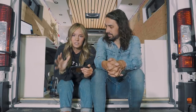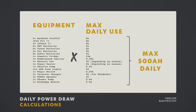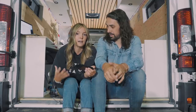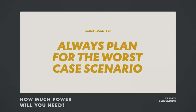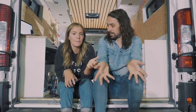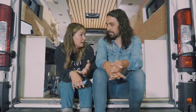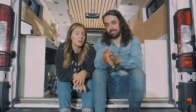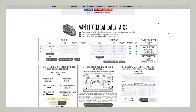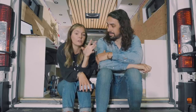Our total, when we use all of this together — and that's obviously the maximum — is around 500 amp-hours daily. So we know our setup needs to power 500 amp-hours on a daily basis in the worst case scenario. You always want to calculate your worst case scenario. It's rarely going to happen, but we needed to list it to make sure our setup would be sufficient when needed. There are many graphs online that allow you to enter your components, calculate the amp-hours, and give you the total. FarOutRide is a very good reference — we'll put the link below.